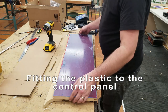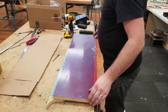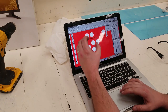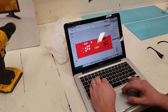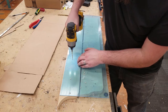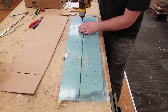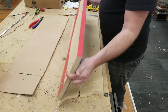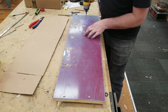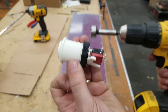This piece goes on top of the control panel — it's going to make it look a little bit cooler and shiny since I'm not adding decals. This one's just going to be red with the buttons. As you can see, I've kind of laid it out in Photoshop — that's kind of the layout and look I'm going for. I'm using white and black buttons and joysticks. I find the more times I drill pilot holes, the less time I get sad. If I drill those pilot holes first and then drill with my 1 and 1/8 inch Forstner bit, it's going to work a whole lot better. This also allows me to transfer my design directly to my control panel.